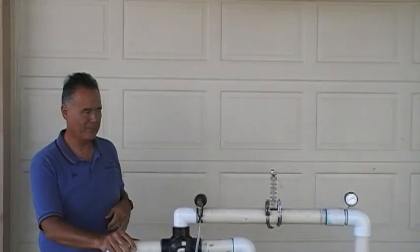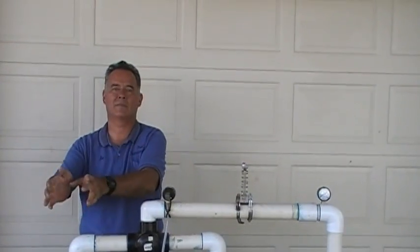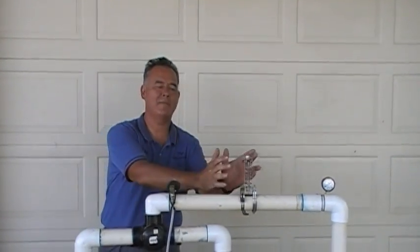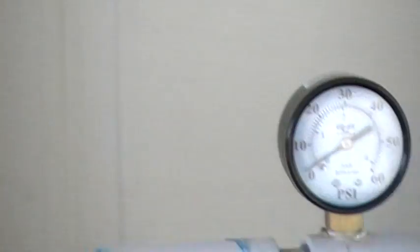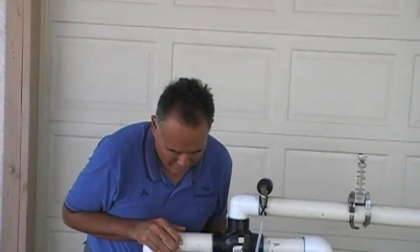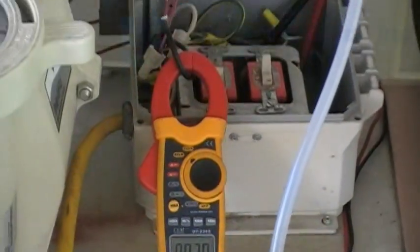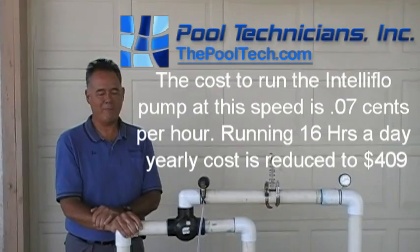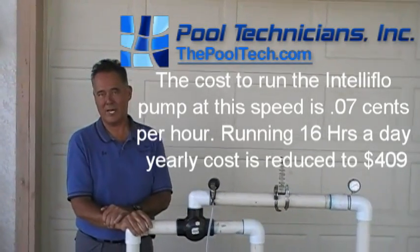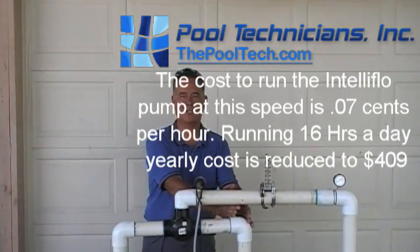Here's where the numbers will make more sense. Let's cut the flow down to 40 gallons a minute. 40 gallons a minute is half of 80 gallons a minute, so we're pumping half the amount of water. The theory behind this is we can run this pump twice as long, pumping it half as fast. At 40 gallons a minute, we also have less pressure, and our kilowatt meter is down to 0.29 — that's 290 watts. We started at 2,000 watts on the older pump and we're now down to 290 watts. If we run this pump twice as long at 290 watts, we can pump the same amount of water for 580 watts that it took 2,000 watts to pump before.